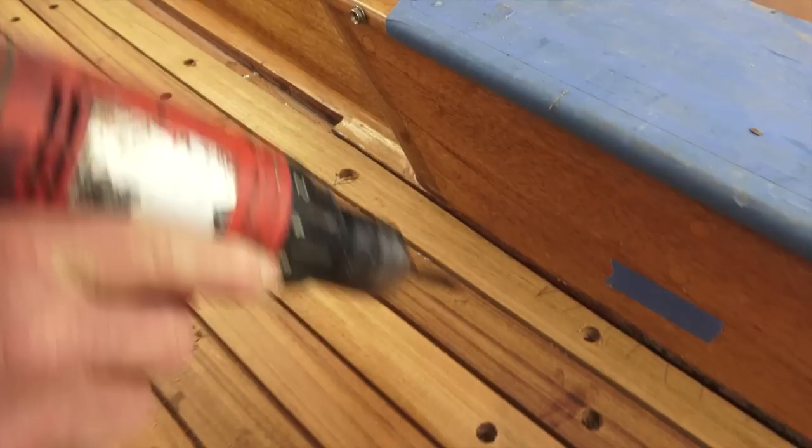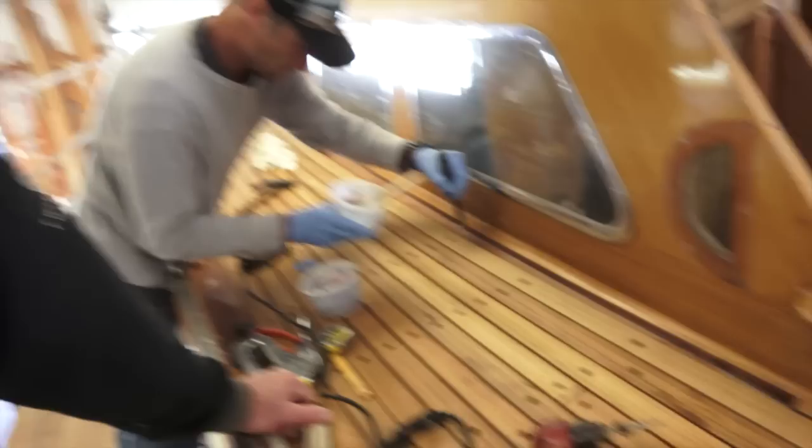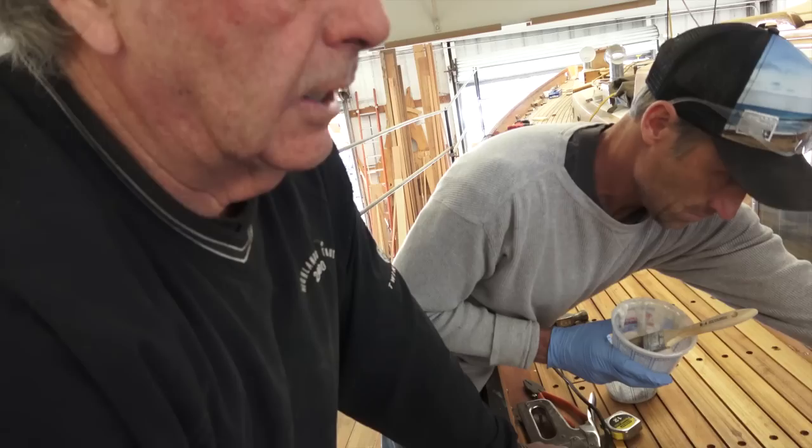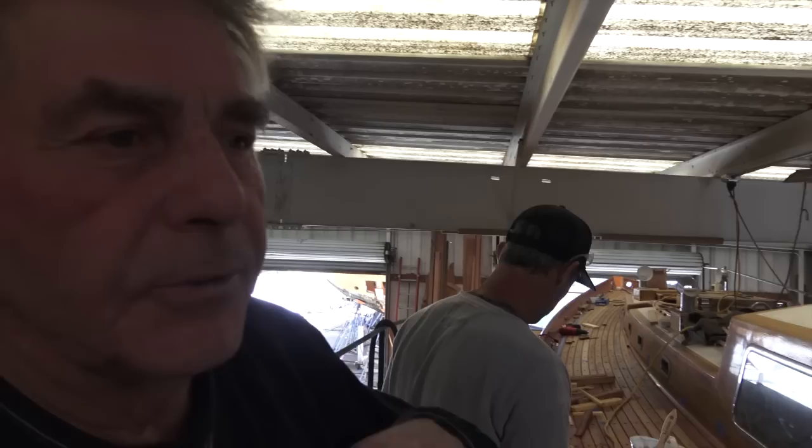And one of my questions, which I asked you last time, was the holes are so deep. Countersunk, yes, because you're going to put plugs in them. But still it doesn't seem like there's much of that screw biting on the wood. Oh yeah, but it's plenty. Well, you got a couple things going for you. You got about a quarter inch of wood underneath the screw head. But underneath the wood is some more wood, so it can't go through. It's compressing it down to the substrate, to the underlayment. And it's glue.